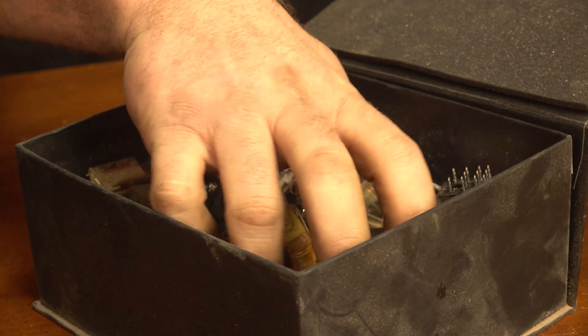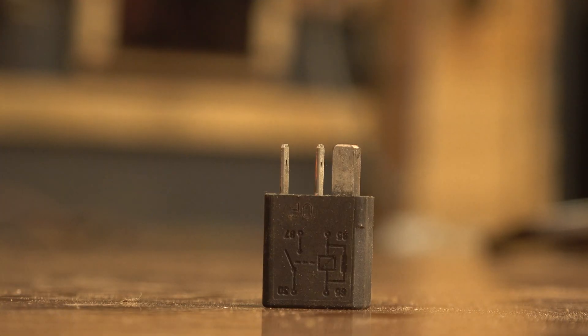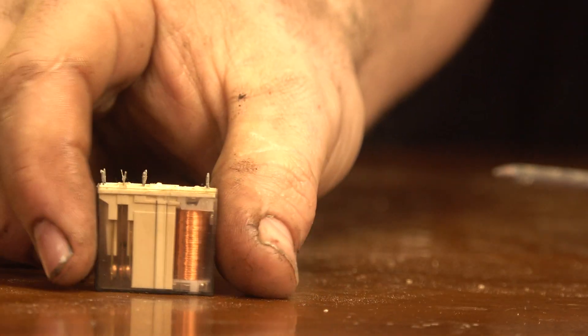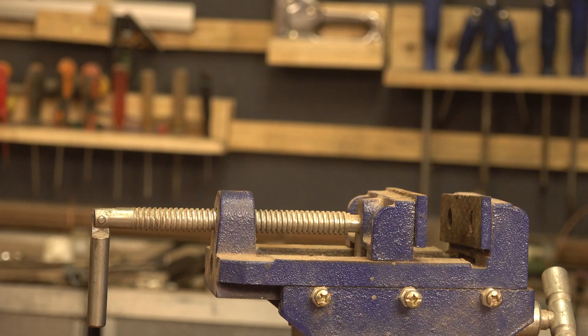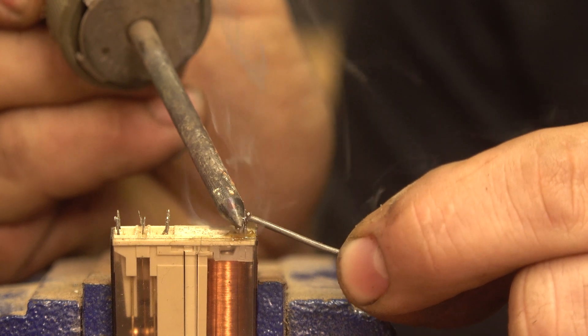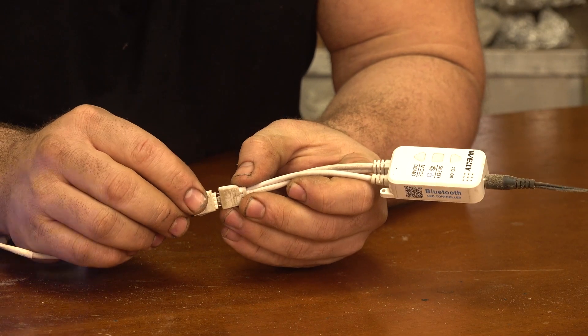Now we need a relay. I have a bunch of them but we only need one that has a 12-volt supply, the same supply as the LED strip. I put links below so you can buy everything you need to build the same project. We just have to connect cables to the coil of the relay — basically every time we give electricity to the coil, we close a little contact. It's like a switch that is controlled electrically. I solder two cables to the coil and two cables to the open contact of the relay, then connect everything to the LED strips following this schematic.